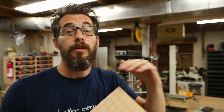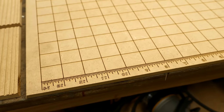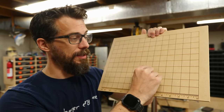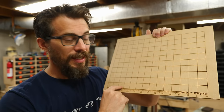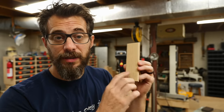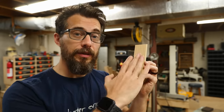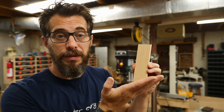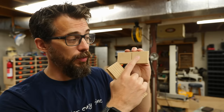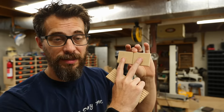Here's where we're at with all the different pieces. We've got the grid cut into this, and you'll notice that the ruler is backwards because we're making a negative — so when you pour the silicone onto this, it should go down into all these little holes and create a positive of each one of these cutouts. The same goes for all the other pieces I made as well. I cut some little lines into these pieces with a saw blade, so when you pour the silicone in those are going to be raised ribs. That way stuff won't roll around in that section. I used the same idea to create a separator within one piece, so it actually breaks that one shape into two separate pieces on the mat.